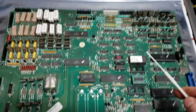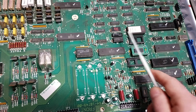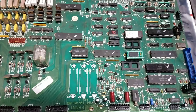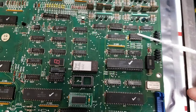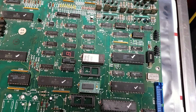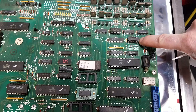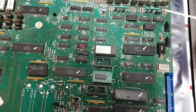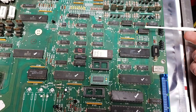I cut out the 6116 RAM and made an NVRAM adapter for it, but after that it still gave no indication. It seemed like there was a really big issue — even the diagnostic digit showed no signs of life. I then looked at the previous repair on U41: flipping the board over there's quite a bit of heat damage on the bottom. It was already socketed with a new chip, but I pulled the socket and found a couple of traces weren't making contact — all the traces on the top side were heat-damaged and floating. I made a map of where they all go and put jumpers on the backside to reinforce all those connections, but that still gave nothing on the digit.